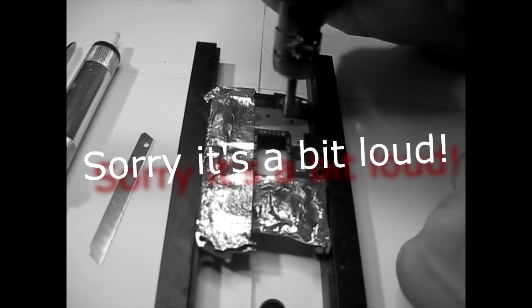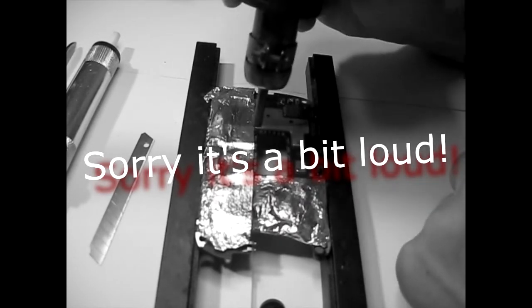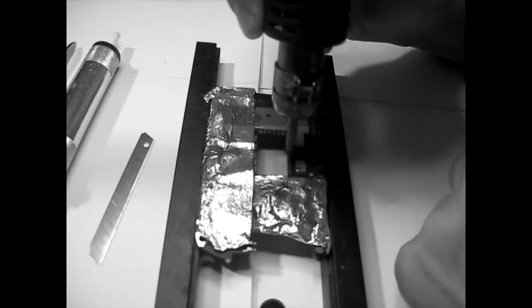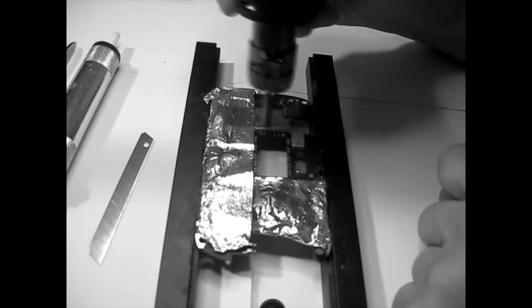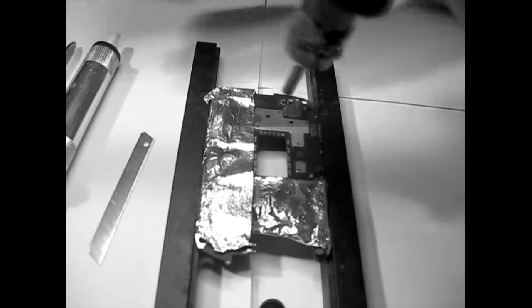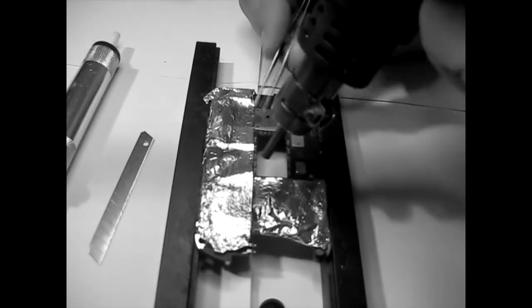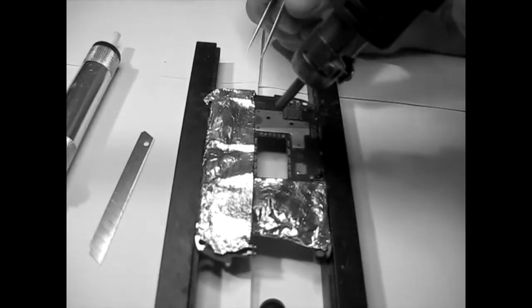So let's start. Solder normally goes down easily when you have 300 degrees and above, it'll melt. What I'm doing here is preparing the board, evenly heating it up so the solder melts a little bit. There's debris on top and stuff like that. Some of it starts to get loose, because you will see it start to shine. It's oxidized now, but when it starts to shine, it means it's ready to be picked up.